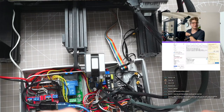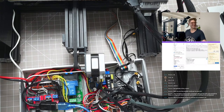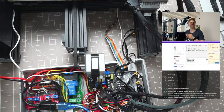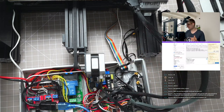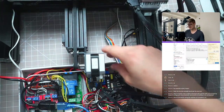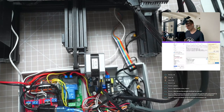I also found a way to make a macropad with just the stuff I have in my house - I'm using a Pro Micro. It's really simple: it's just buttons and a microcontroller. I went with that design. It's a microcontroller that acts as a keyboard. I'm directly wiring the switches so I'm limited to 18. If you have buttons, you link them as a grid, and then if two connections are active, you know which switch is pressed - you can have way more switches than connections. For a macropad, having 18 is not a big deal - I have 12 and it's more than I need.